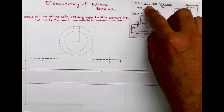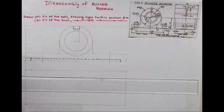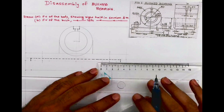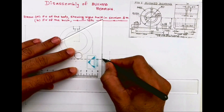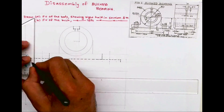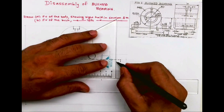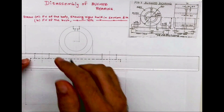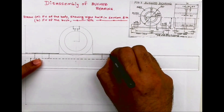The inside part we are not drawing apart from that. Now I need to draw those two dotted lines. It is 25 — if you see, that is an oval-shaped hole of 25 by 20. So in front view we can see 25, and in the inside view it's diameter 20. The dotted line will go only till here — it won't be through and through because there is a cavity down there, so that much part is dark.